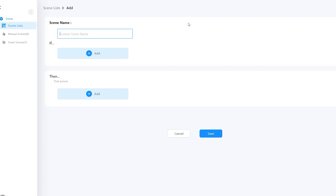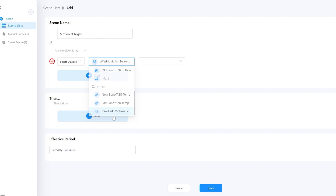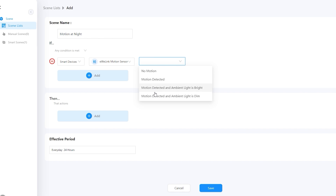Encouraged by this, I went to the automation panel to check the options available for motion detection. With this sensor, I had 4 different trigger options: motion detection, no motion detection, and 2 options for detecting motion during bright times and dim times. As mentioned, there is no way of controlling the brightness threshold, which is a shame, but for most automations that aren't critical at dusk and dawn it should be fine. I also wanted to test the range — it's advertised at 6 meters, but my rooms are smaller than that so I couldn't confirm it. One thing to remember: this is infrared, so it uses heat detection, meaning pets could trigger it too, depending on the animal and conditions.